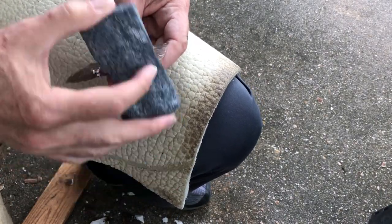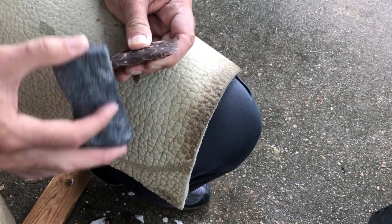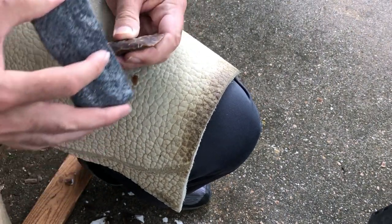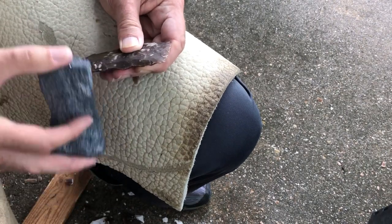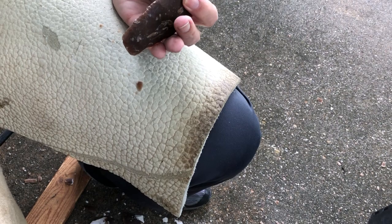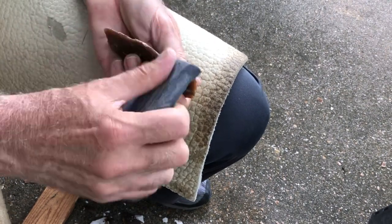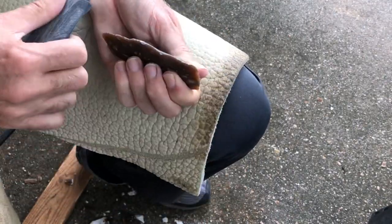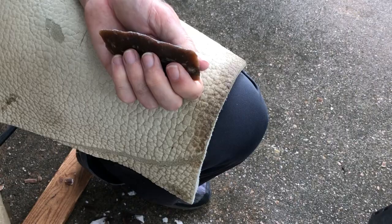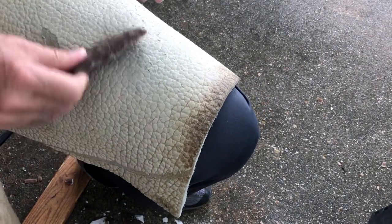And that's the same reason I go kind of light on hitting with a coarse abrader, because it does take flakes. But if you angle it backward a little bit and go kind of light, it's sort of taking the flakes only on high spots, and it makes them come off relatively clean. And you can knock them off with a hammerstone too. If you get one that's fairly hard and it doesn't grab, then that's clean.